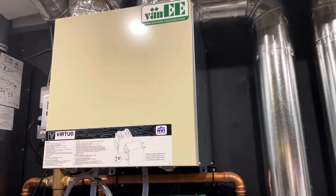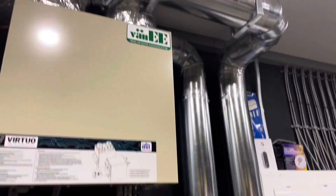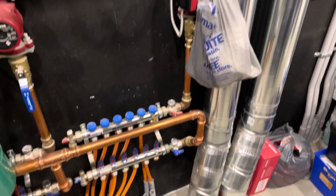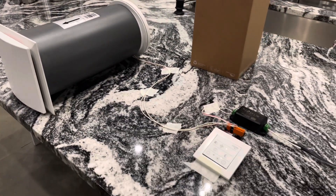Here's your traditional HRV system — some of them recirculate, some of them don't. This one is actually ducted from there down through the floor and makes its way around the house. That duct is going to be a supply for fresh air from outside to inside, and it actually pulls the used air from the house through the bathrooms and the kitchen.